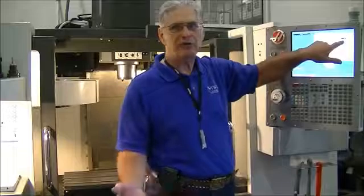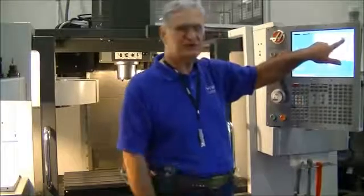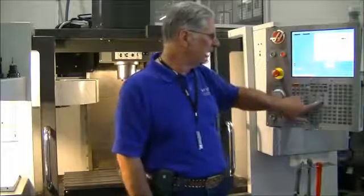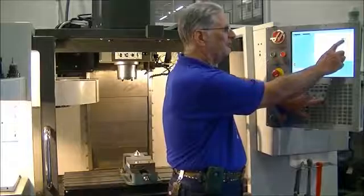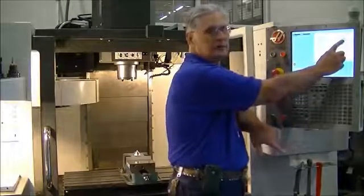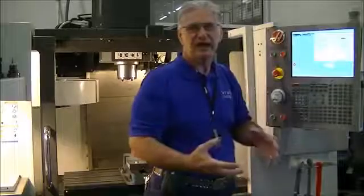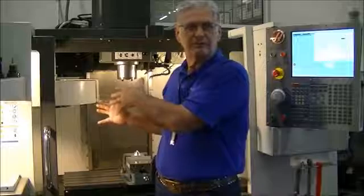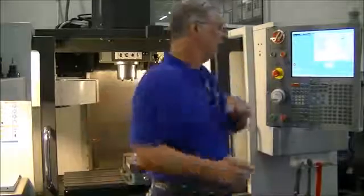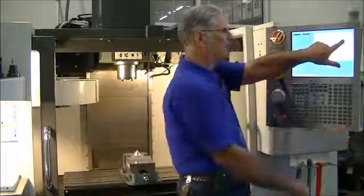So what I want to do is turn on the ability to override that switch. So I want to change this setting. To make a change, I would press the right arrow key. This changes it from off to on. The door safety override is now engaged, which means the safety on the door will not function. I'm going to press enter to actually set that.